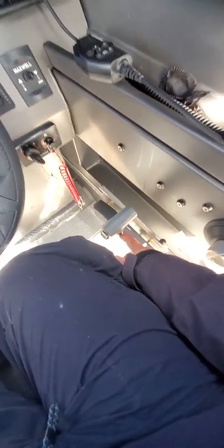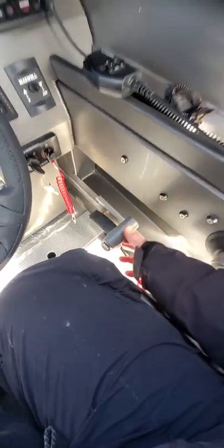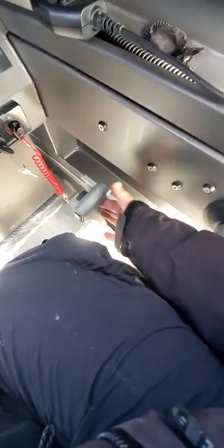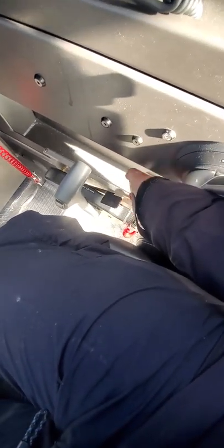Okay, kicker motor. I'll watch the time, I might have to do three videos. When you're starting this up, make sure you pump the primer bulb. Lift up on this red lever, give that maybe four pumps, bring it back, lift this lever right here up to where you feel it stop, then just give it a little beyond that. And then you push in on the key like this, push and turn to start it. If it acts like it's gonna die, push in again. Until you hear the idle pick up, then don't push the choke, just bring this lever down a hair, let the idle drop, it'll come up again, drop it down, and then you should be able to put it in gear and go.